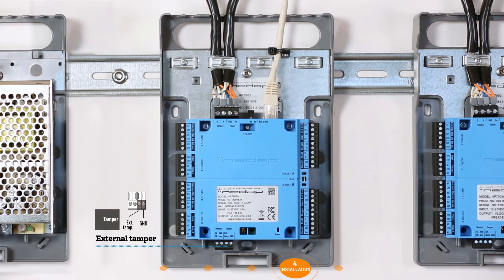There are three inputs on the underside of the devices. These can optionally be used for an AC-OK input, a battery-low input, or an external tamper input. Please note: all three inputs use the same ground.